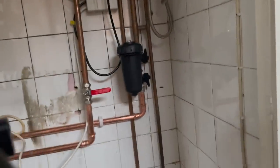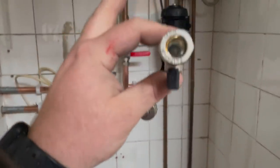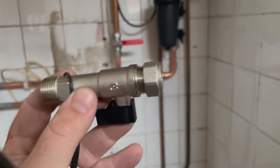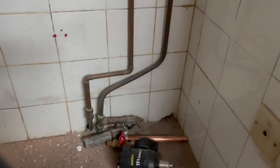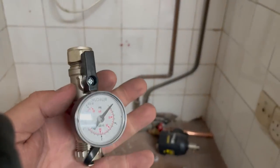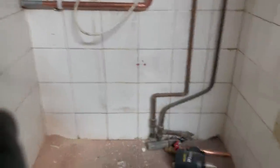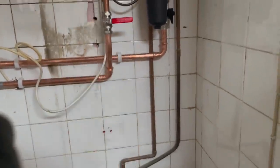You've still got a standard hose. This valve is the same as the one up there - this goes on your cold main. It's got a directional arrow and a double check valve - non-return valve - which is a sprung-loaded piece of plastic with a rubber washer, so water can travel one way but nothing can go back. That's to adhere to Water Regulations. The difference is this piece here - basically identical to the standard one, just with a little pressure gauge on it, which means when you're filling up you can see what you're filling to. Saves you over-pressurising or under-pressurising.